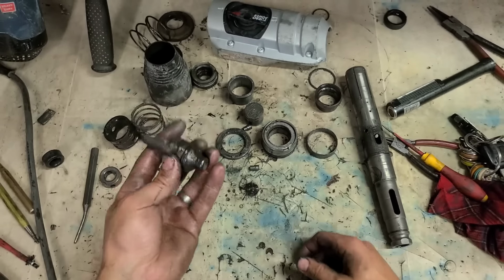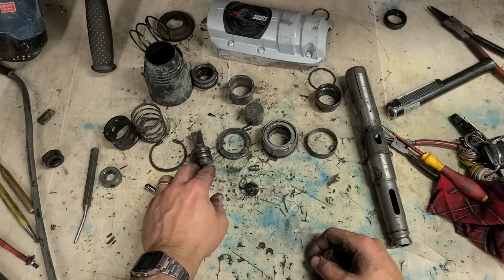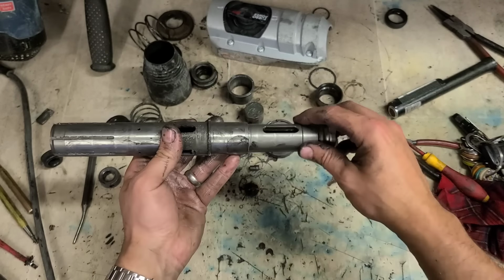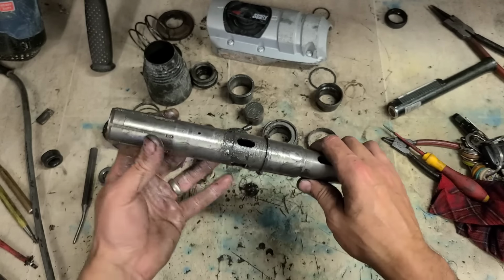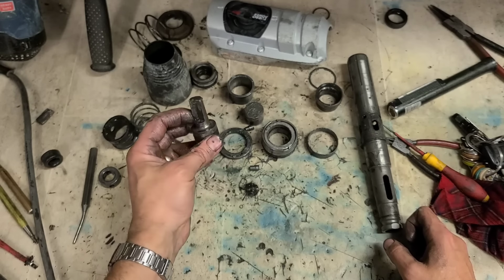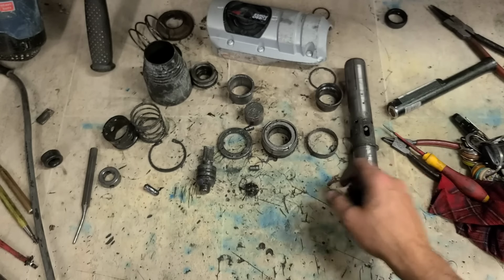I think that's the first one of them I've ever seen break on a Bosch. Normally see it in something like a Hilti, never a Bosch. Don't even think I've ever seen it in Makita either. Milwaukees, sometimes they break, but it's generally because the tool holder snaps in half here. So the actual tool holder breaks away from the hammer pipe. The Hiltis can sometimes just shatter or mushroom down here and jam up. Never seen it in the Bosch.